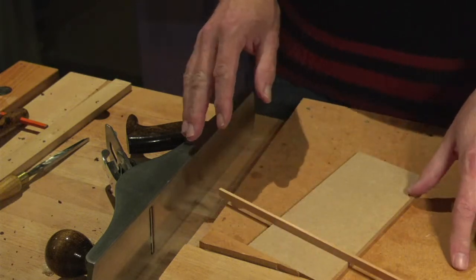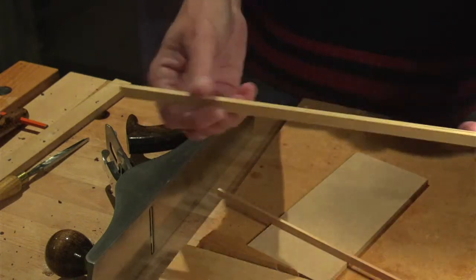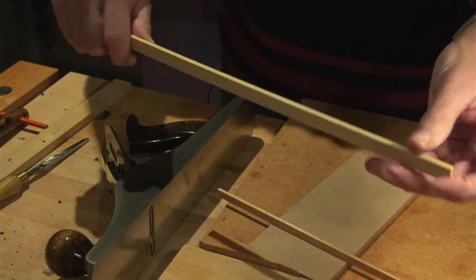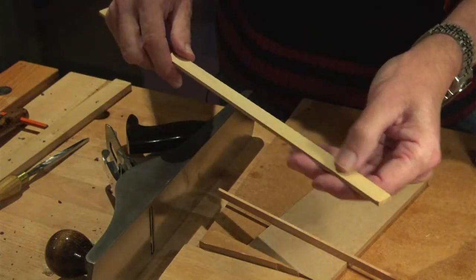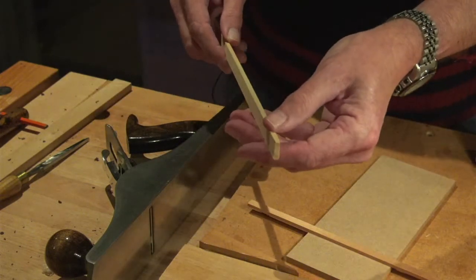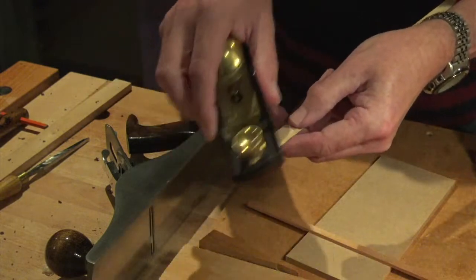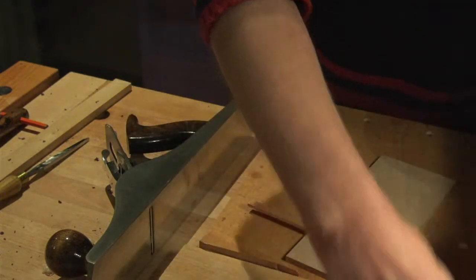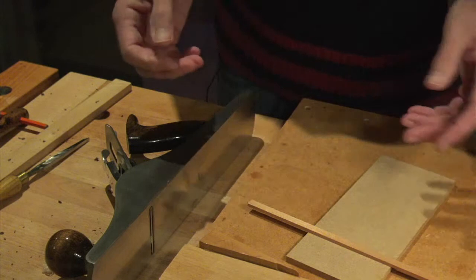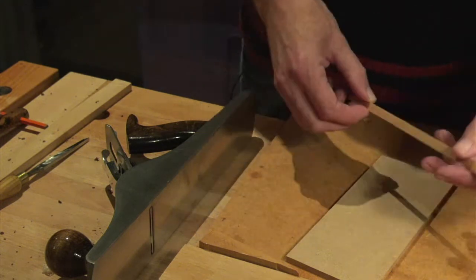If you're making something to measure larger boxes, which of course you could be, then you'll be using larger arms on there, so they'd be a lot thicker. So in their length and width, their whippiness will be a lot less. Obviously got to chop a bigger mortise. For the ends of those, because it's larger material, it's much easier then to put a double bevel on it. It's easier to hold, and you could work that with a block plane, basically like that, to put a bevel on both sides. If you're doing really big work, you can imagine you could use a couple of, I don't know, 1x2s in a large piece of 4x4 as your locking block. But I think this should be fine.